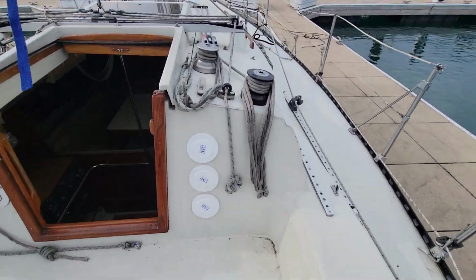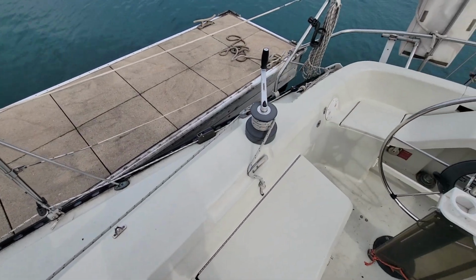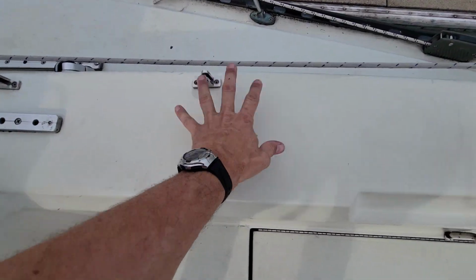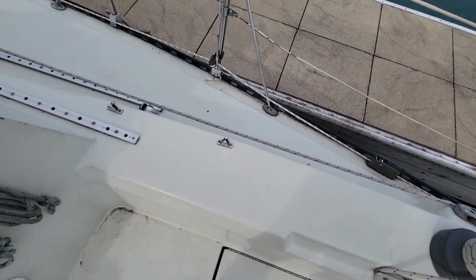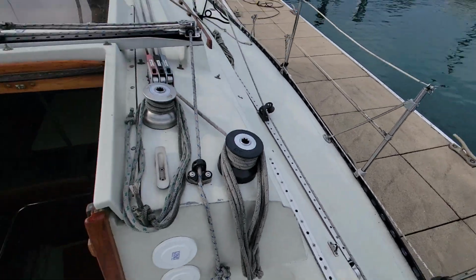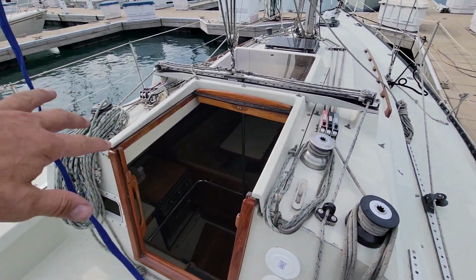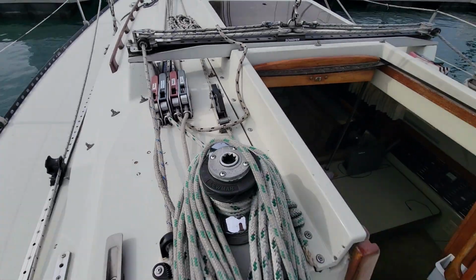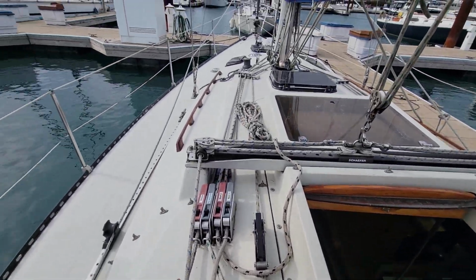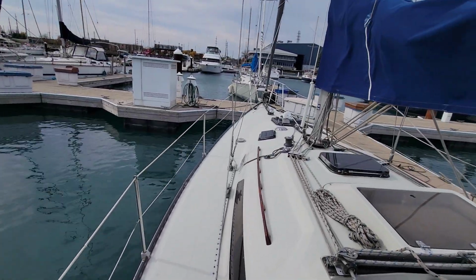Instruments on here, and then we've got plenty of winches. So this boat doesn't have the self-tailers here. The boat I had another set here and they were self-tailing. So we used that for spin, and then the self-tailers for the jib. It's got anywhere from 3 to 4 on the layout for the cabin top. This one used to have a 4th over here, but was removed. Self-tailing winch. And then going forward, we got a nice long car rail, goes all the way up.